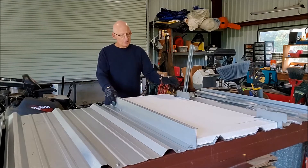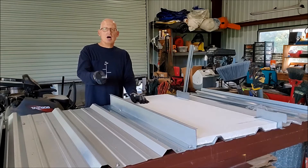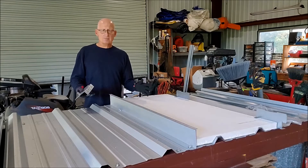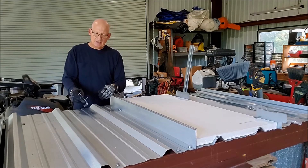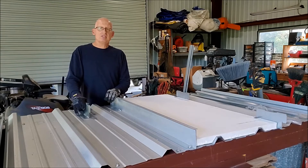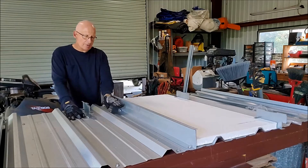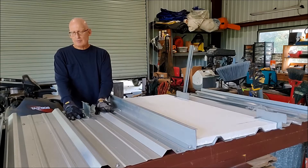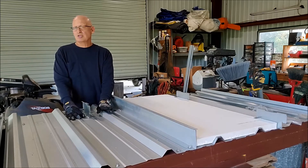It all starts with the idea of using a clip that is extra tall with a tall offset. This clip is in a symmetrical standing seam — I use my 238T panel — but we use an extra tall clip. The idea is that you set this 1.75-inch offset clip right between the ribs of the existing R-Panel, fasten it down into the purlin, and it holds the new panel up above the ribs of the R-Panel. So with a 1.75-inch offset, you can use it on panels up to about a 1.5-inch rib height and it's going to work just fine.